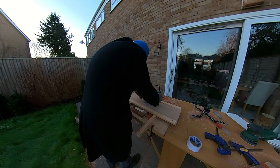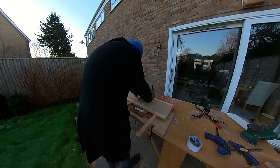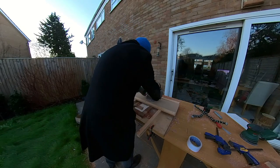This time you'll probably start to cut through the wood, bringing the thickness down. Once you've run all the way across, push it away again, then over to the right, and repeat the process again, moving slightly closer than on the last pass. Keep repeating this process, slowly moving down the workpiece.